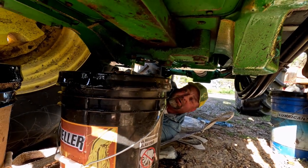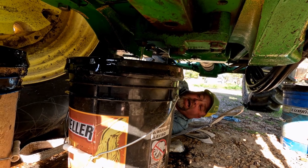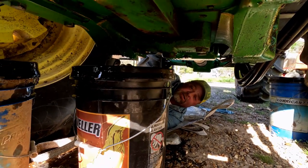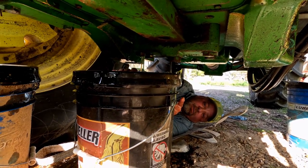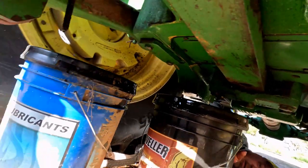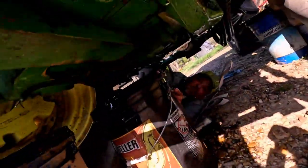We talked to a mechanic — our daddy is a little more mechanically inclined than I am. We started running it again and got to watching the sight glass, noticing it looked a little milky when the PTO was running. So we figured we had a little moisture in there. It wasn't milky really — you couldn't really see obvious milky oil. So what we're going to do is change both filters, drain everything out, and see what happens. Jacob went to the John Deere place in Bolton called Ag Up and got us a new sight glass — ours was leaking real bad around it.